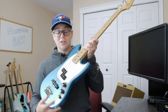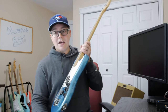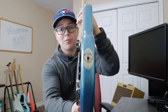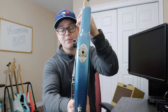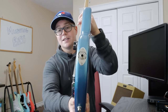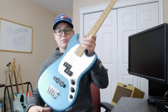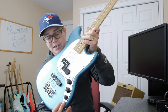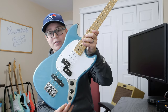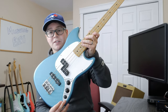So I had to be very careful in doing this drilling here for the input jack. As you can see, that football plate is about the width of the guitar, so I had to be very precise in centering it. It's a hair off-center, but I think I did a great job. I also had to route out under the plate to get that third potentiometer in where the input jack was, being very careful not to chip the paint on the top of the guitar.